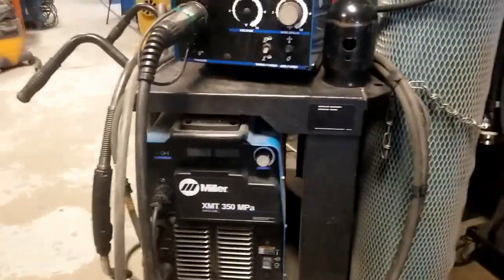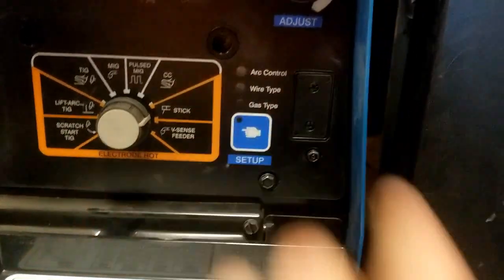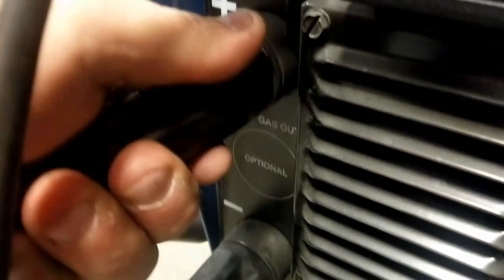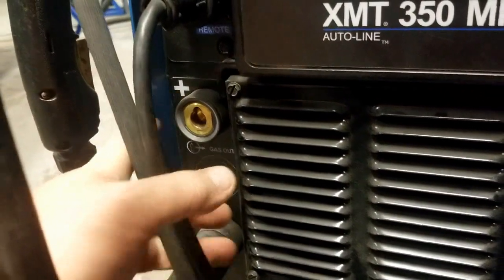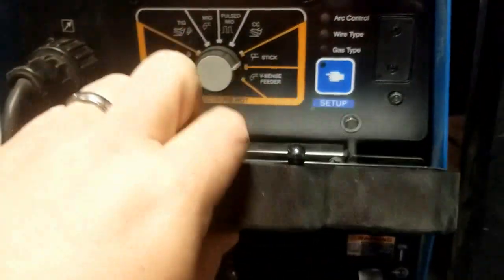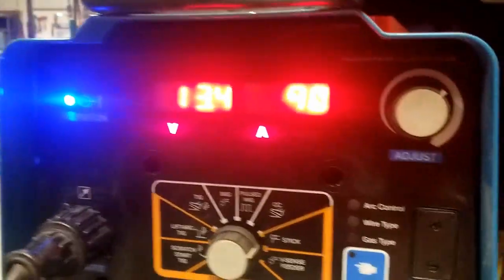Now, real quick before we close — just for comparison — the XMT 350 MPA. When we open the lid, it looks the same. The only difference really is instead of having an inductance control, we have a setup button. If I power this machine on right now, the feeder is still hooked up. So if we get it switched for stick, I'm going to disconnect this connector right here. In terms of a stick setup, I would simply plug my stinger in directly here, or have an extra length of cable if I needed more length — basically it's just going to plug directly into the positive. We effectively did that on the other machine by plugging into the other end of the harness, so it's like having a stinger that's 25 or 30 feet long. We're in stick mode, so I'm going to flip the power on and wait for the machine to cycle up.